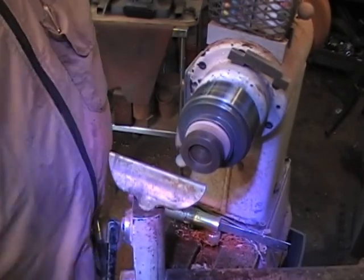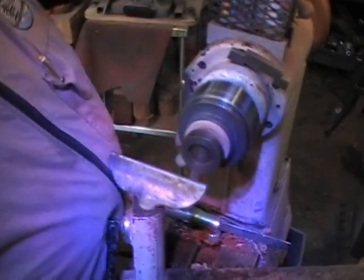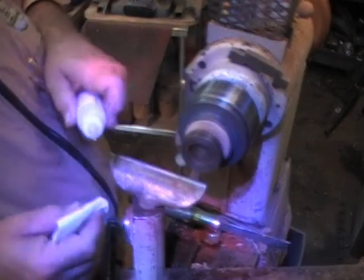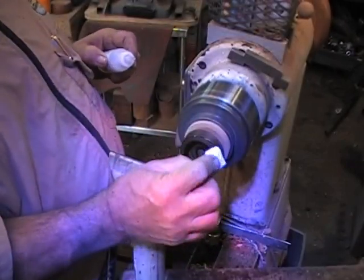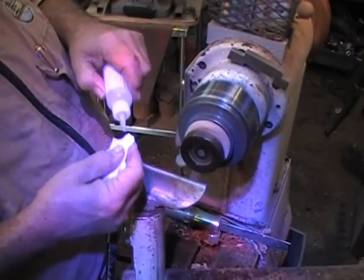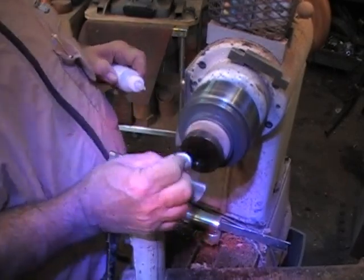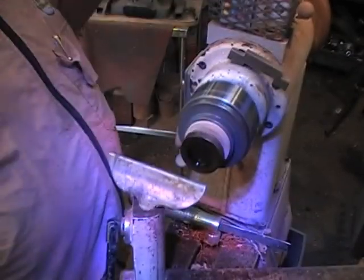You're probably saying, why did he jump to the CA finish? Well — alcohol. This is going to be used in and around alcohol, and the most durable finish I have for that is CA. And it takes that much to put an awesome finish on the bottom of this piece.